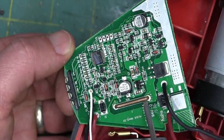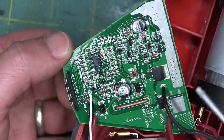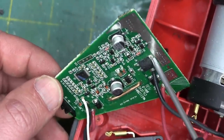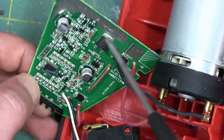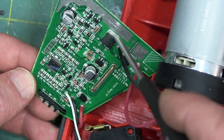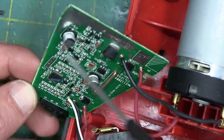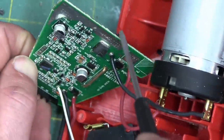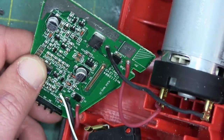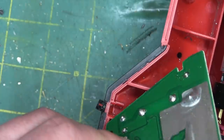A current shunt here to see what the voltage drop across there is, and if the voltage drop is too high, that means there's too much current going through. It would very likely open this MOSFET to allow it to cool down. This MOSFET — there's no heat sink on there. However, built into the board through the vias, there's a whole lot of heat sinking on the back side here. According to application notes — this is an International Rectifier — somebody had posted that on a package that size, you really only need 11 or so through-hole vias, like these little dots, to another back plane to allow that to sink enough heat so it doesn't fry up. I'm kind of old school: more copper, more better. But there is an application note to allow you to do this type of thing, building the heat sinking into the PCB.